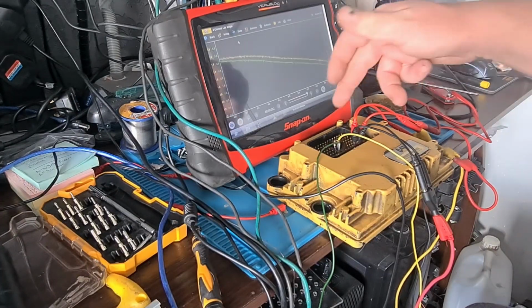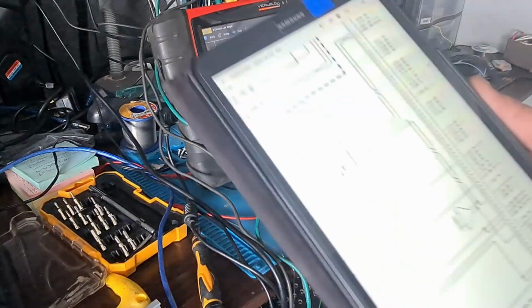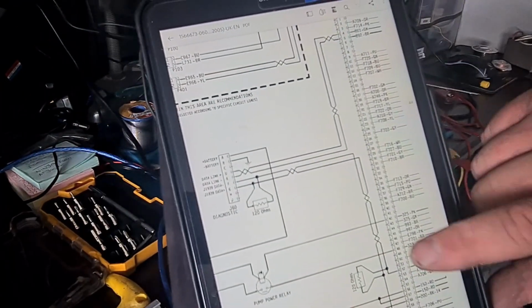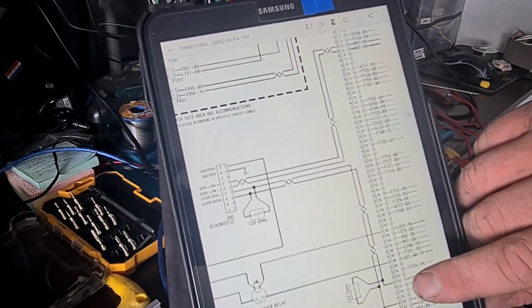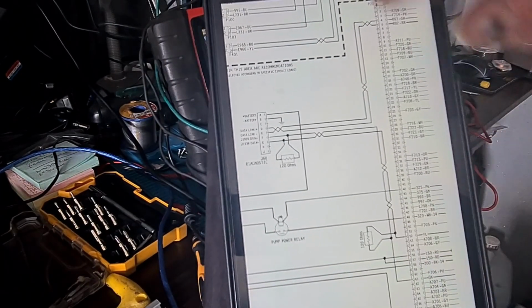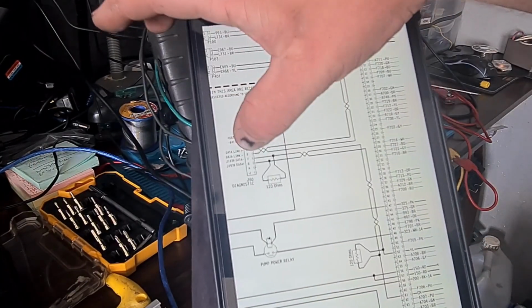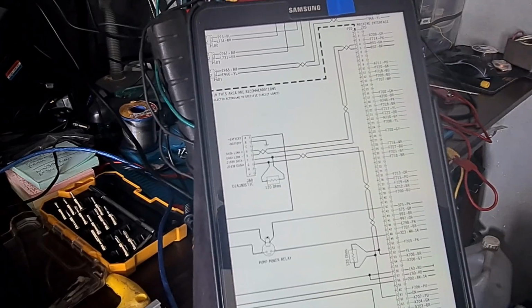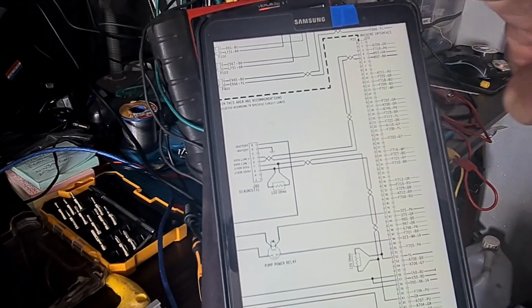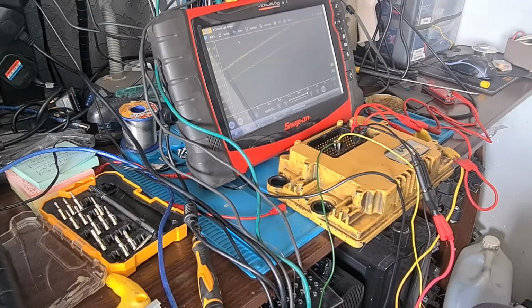So what I've done is I've put my communication lines on. They go in pins 61 and 52, and you see you've got a 120 ohm resistor there and one there at the connector, which I tested. These 2 lines at the connector we had 60 ohms, so I wasn't bothered about that. So I've got the snap-on now, so we can test our CAN bus.